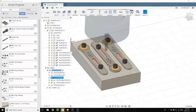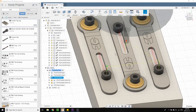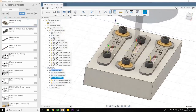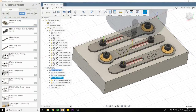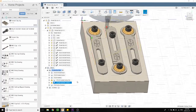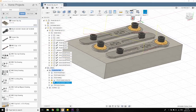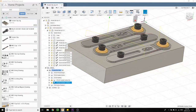Then we're going to slot out this decorative hole — technically slotting, but with about 5 to 10 thou clearance around that part so we can clean up all the walls without doing a climb or conventional cut. Once that's finished we put the socket head cap screws and brass washers in place to help align everything correctly. Then we do a roughing operation to take away the majority of the stock around the outside, followed by a finishing operation to give the pocket clips a nice clean edge. I'm also cutting a little deeper than the stock into the aluminum fixture so we don't leave a skin on the bottom of the part.